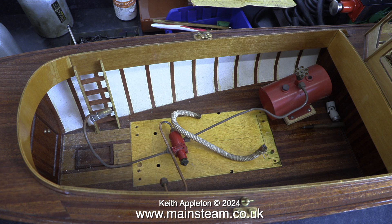It's a real strange box of tricks. The gas tank is connected to a gas regulator which in turn connects to the top of the water gauge. When I open the gas valve no gas comes out of the end of the pipe that fits into the boiler, which also does not have a jet. The thread for a gas jet is normally 1BA but this is some sort of a metric thread. Looking closer at the steam plant, it does have the feel of being made in China.